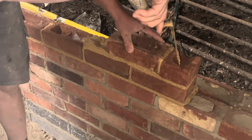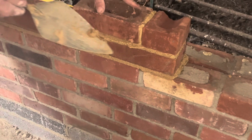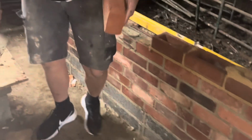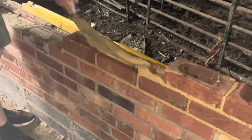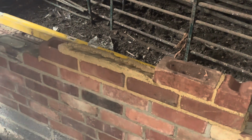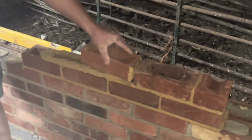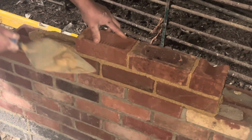As you can see, I've just pinned it with the tip of my trowel. It don't go anywhere. And this is my best guess. Before I put the level on, I'm doing it to get my best guess. Yeah? So it's all judged with the eye until you get the length that you want it at. Yeah? Again, very light tap, up and down, get that joint fill.